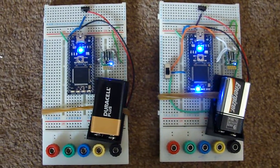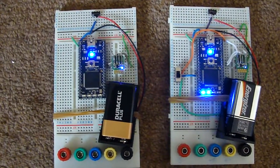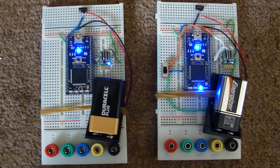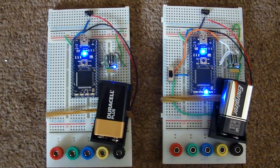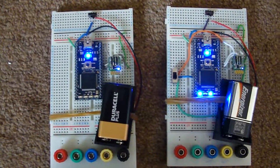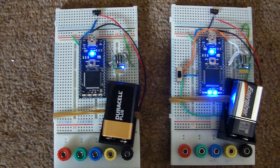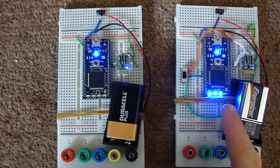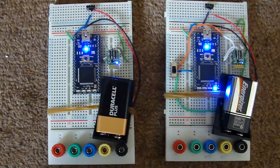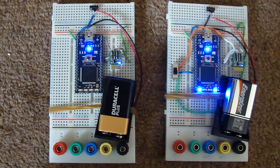So not much happening. Now this mbed here goes into a quite slow sequence, which is counting in binary, and you can see the 4 LEDs coming on to count binary between 0 and 15. Now what's happening is they're just finalizing the connection, and eventually this count value on here is also being broadcast on Bluetooth. So eventually this one should latch on and start receiving that broadcast and display the same count variable.